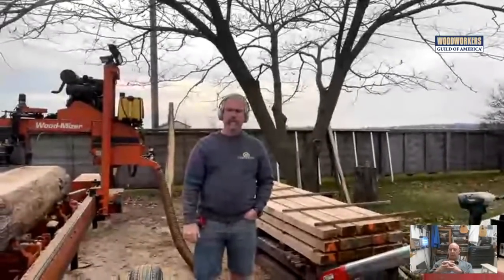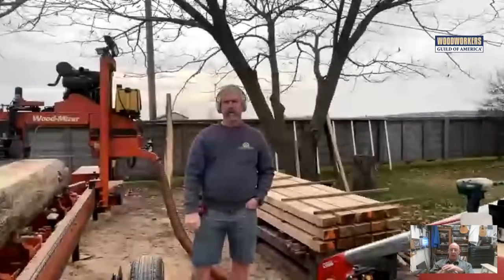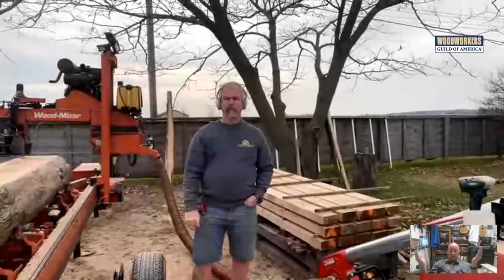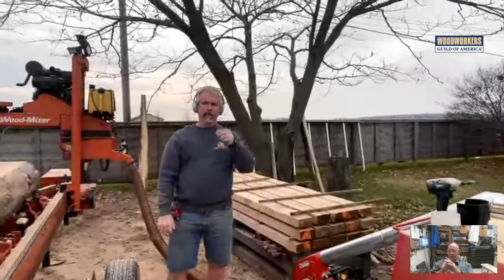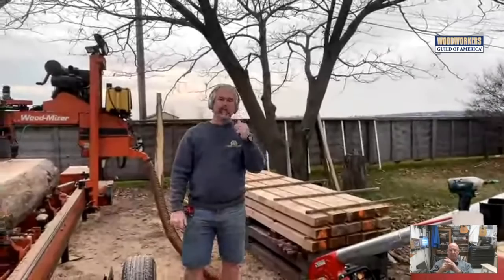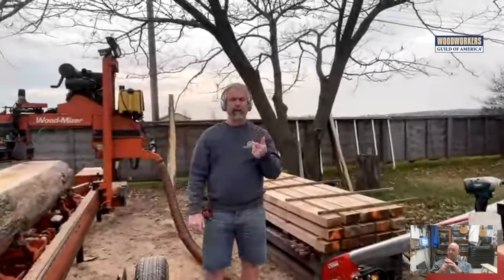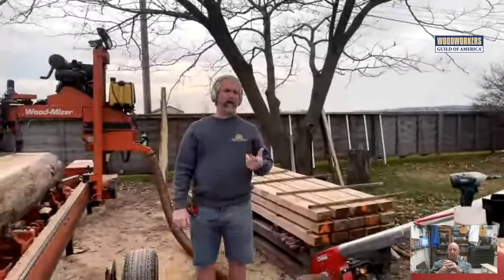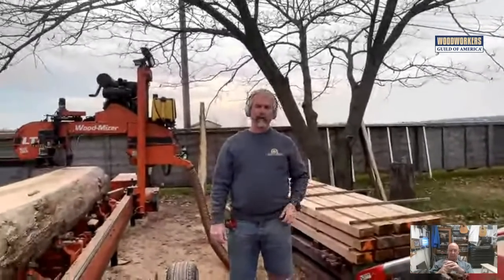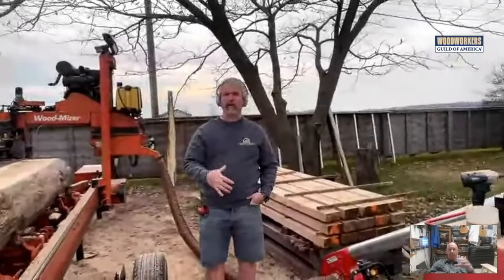But the stuff that you're cutting is going into your use, right? I mean, you're air drying your slab stock, your bow ties are raw material off of your air dried stuff. Is that right? Yes. And especially we use a lot of walnut. And walnut is one of those woods that the longer it air dries, the richer the color is. So we will push the walnut to air dry a few more months longer than the maple or the cherry that we use. The cherry can also benefit from more air drying.